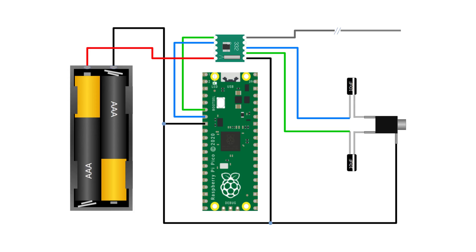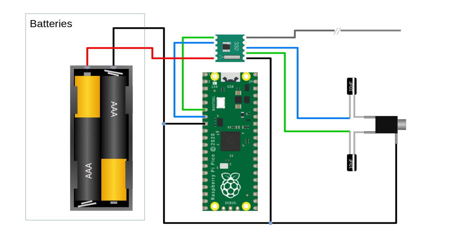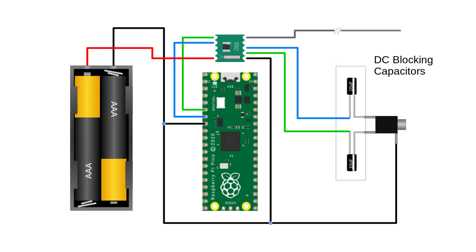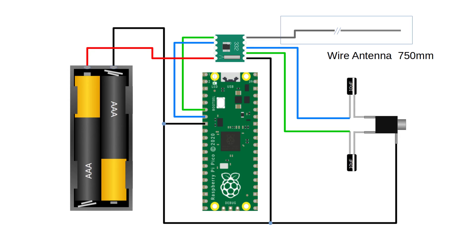To start with I just want to build a very minimal circuit — just connect the radio module to the Pi Pico and make sure everything's working. The module needs a power supply between 2.7 and 3.3 volts. The most convenient way to power the module would be using the 3.3 volt output from the Pi Pico, but when I tried this it was too noisy and the radio just didn't work. For these initial experiments I used two AAA batteries to give a simple low noise supply. The radio module is capable of driving 32 ohms directly, meaning we can connect it straight to some headphones without any external amplifier. I use a standard 3.5mm stereo headphone jack and a couple of 10uF capacitors to block any DC. The antenna couldn't be simpler — it's just a piece of wire, about 750mm, which is the right length for the FM broadcast band.